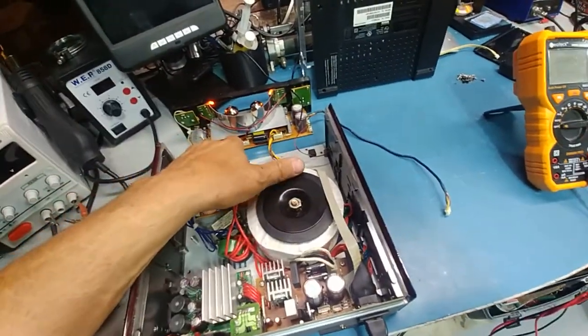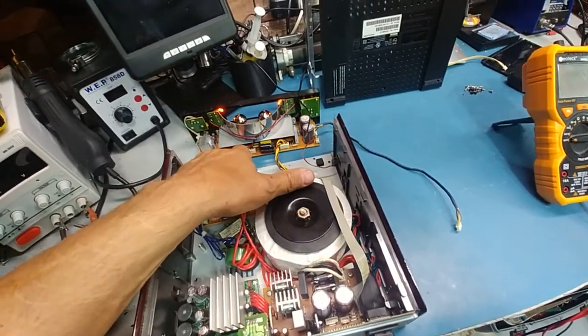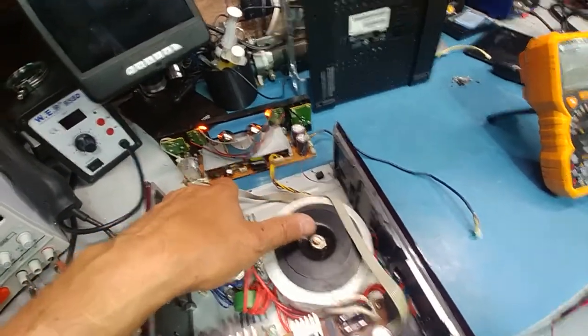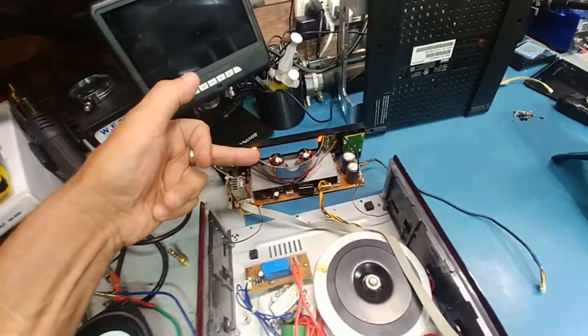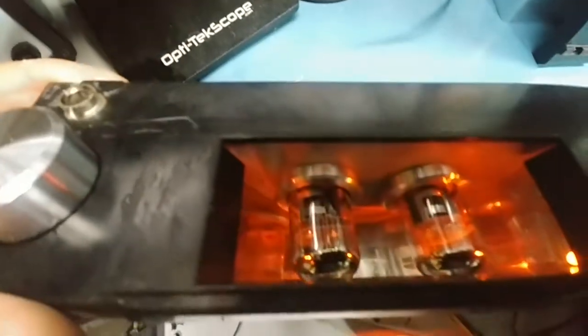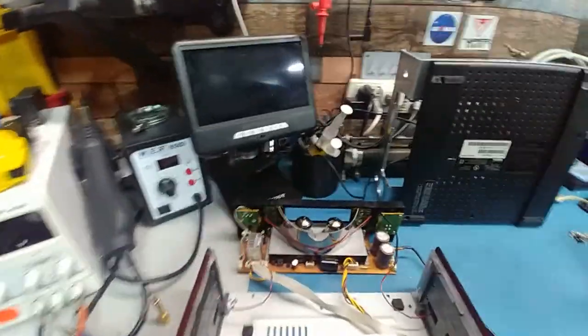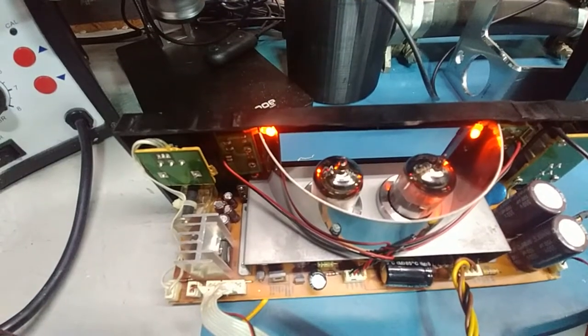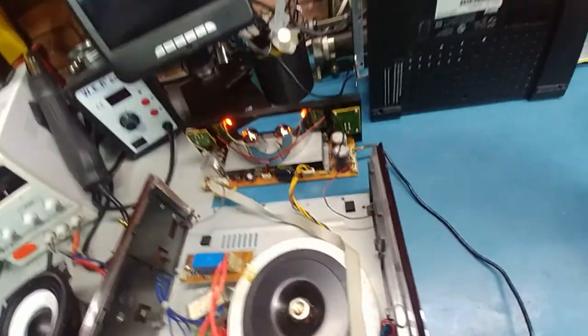It's been a fun ride through hell but I managed to get it to power up a little bit, as you can see. The issue was the regulator wouldn't fire off because it's missing the other half of the unit, so I basically used a yellow wire and bridged it right to the tube socket, which the LEDs are tied into. As you can see, the filaments are lit up as well as the LEDs. It's kind of weird how they light up - watch, turn it off, plug it in, now it's on. It slowly warms up. Maybe it's designed like that to give it that glow look.